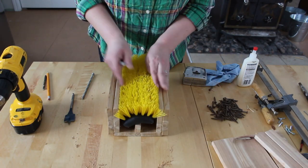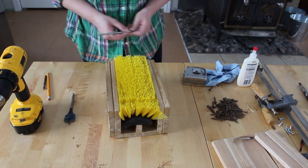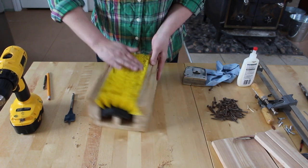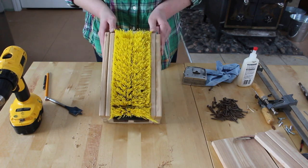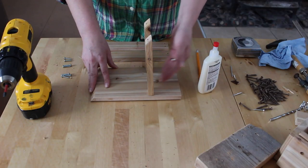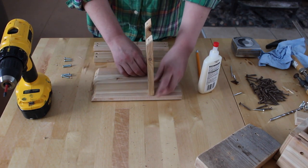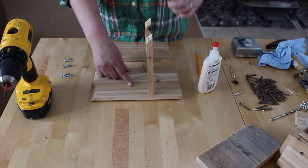Okay, let's try it out. It seems to be in there pretty well — it's great! Next step is to attach it to a stand. I've already marked three inches in on the 10-inch board, which I added a 45-degree angle to the edge, and then attached two of the off-cuts from the 4-inch wide boards with screws.